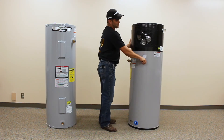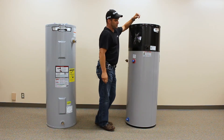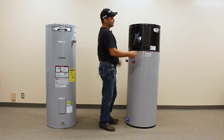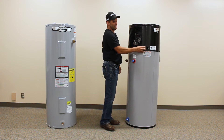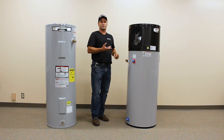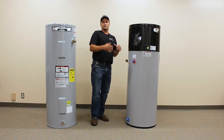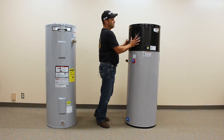Being an air conditioner — or acting as an air conditioner on top — much like an air conditioner in a home or in a window, it is going to pull moisture from the air. So we've got a couple of condensate drains here. This is the primary and this is a secondary backup. One thing you'll need if you want to install this is a condensate drain somewhere nearby.